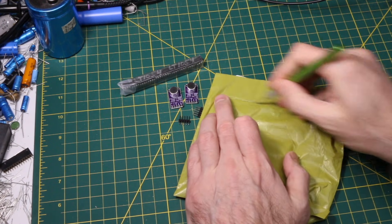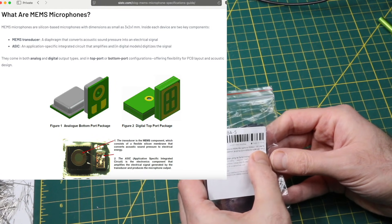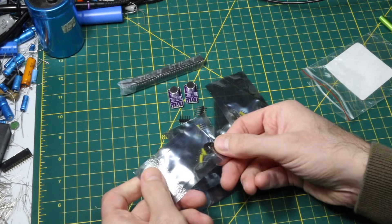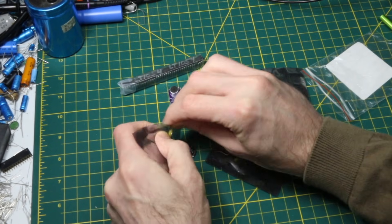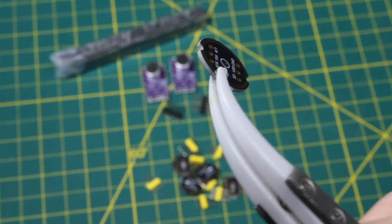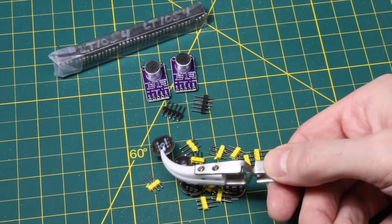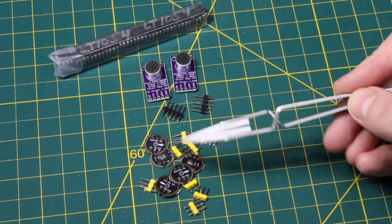While ordering microphone and audio related stuff, I threw in an order for another MEMS microphone with an I2S interface. I had bought several versions of these to experiment with years ago — you can use them easily with ESP32. Now I have five more of a certain style. These were relatively easy to get up and running and sounded reasonably good. The module has an opening for the microphone audio, plus power, ground, and the I2S data pins: word select, left or right channel, clock, and data. There are libraries out there to easily get these running, so maybe I can use a MEMS microphone in another lo-fi sampler project.